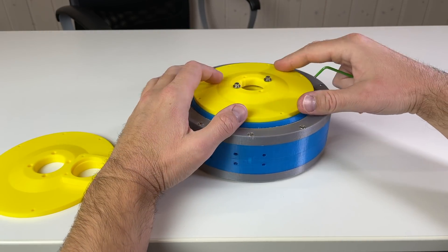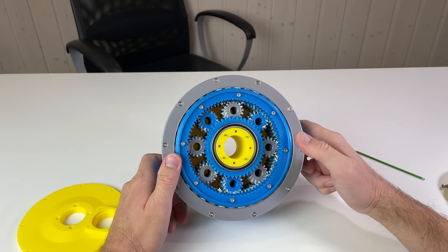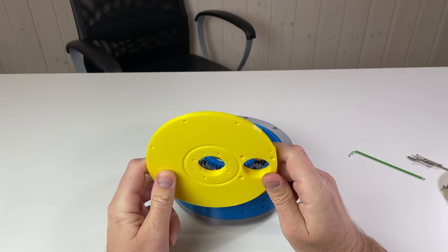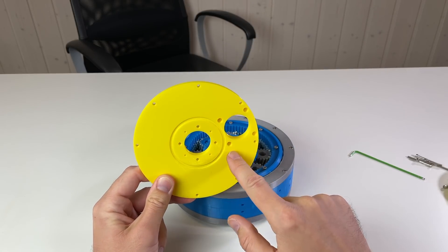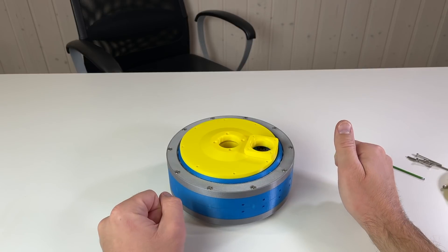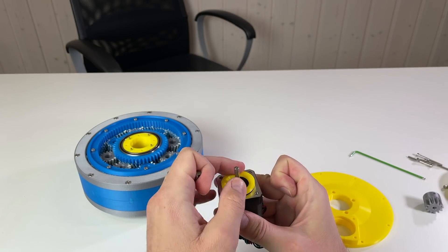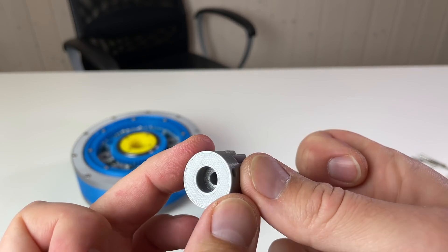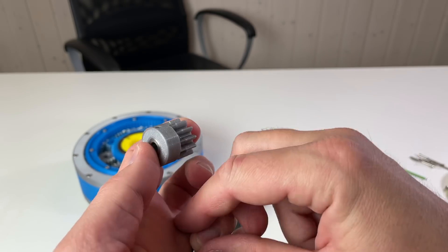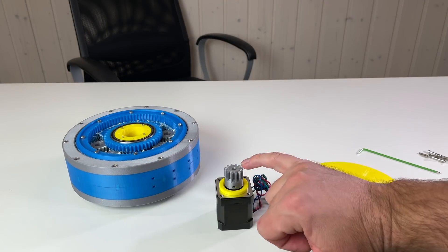To make everything run smoothly I need to put some grease, then mount one cover from one side and another cover from the other side. Now I align all the holes using two screws and fix it with a lot of screws — looks cool! Now I remember that I cannot install this piece before the stepper motor, because the screw holes to fix the stepper are accessed from this side. So first we put the stepper motor, and only afterwards mount this plate. I'll use a metal collar inside the small gear on the stepper shaft and a headless set screw so all the torque is transmitted through this screw.